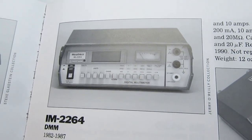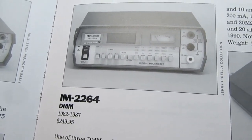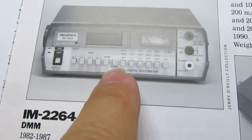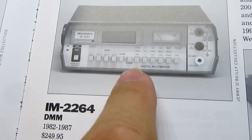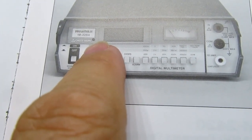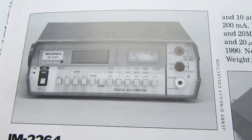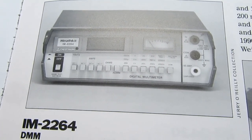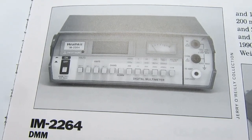These days it's common to have digital multimeters with a little bar graph on the display underneath the numeric readout, which performs a similar function to this little meter. They also added a button for an alarm function which allows it to act as an audible continuity tester and in a couple of other ways. Finally, they added an LED just to the left of the LCD display as a crest warning, which lights up to indicate you're out of range — useful if you can't be reading the display directly.